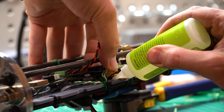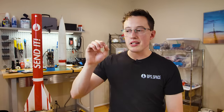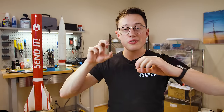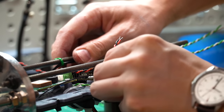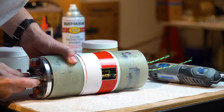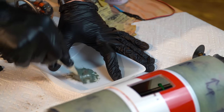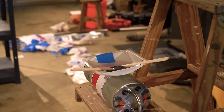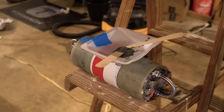The two XT30 connectors are placed at a mild angle, making it very hard for the hatch to naturally back out — because of the cant of the connectors, it's really difficult to remove the hatch unless you're pulling extremely hard. To build the hatch, I CA glued the XT30 connectors in place, coated the bridge connectors in epoxy, inserted them into the avionics bay, placed the hatch over them, and let that cure with a space heater before applying a second coat of epoxy on both connectors.